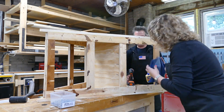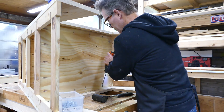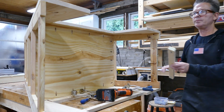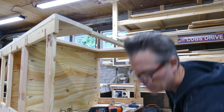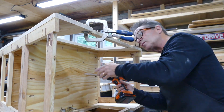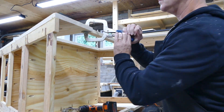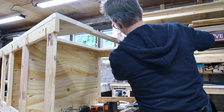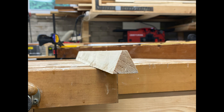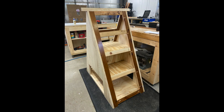Now it's time to install the floors. We do this with wood glue and pocket screws. We also install a bottom piece to the front and back of the project using more glue and pocket screws — this will hide the edge of the plywood. To make a solid peak that we can attach the corrugated metal to, I rip a piece of 2x4 using the same 22.5 degree angle. This piece will help form the overhang by a couple inches on the front and back of the house.